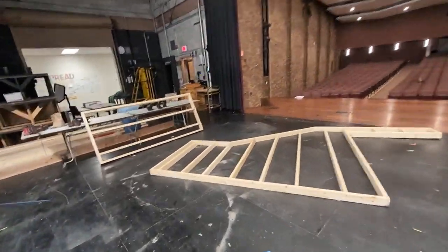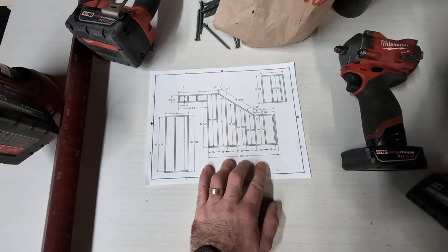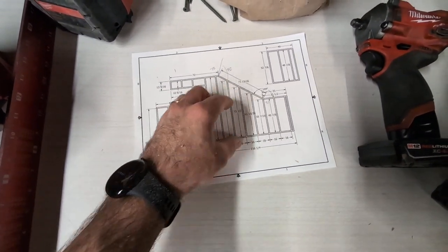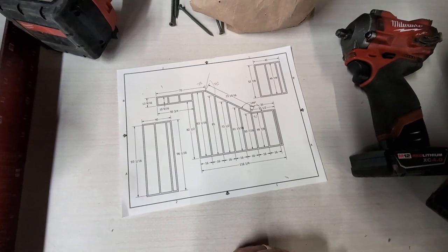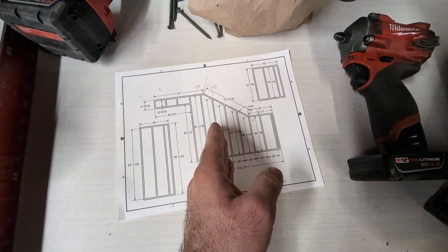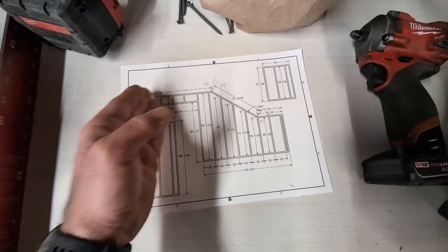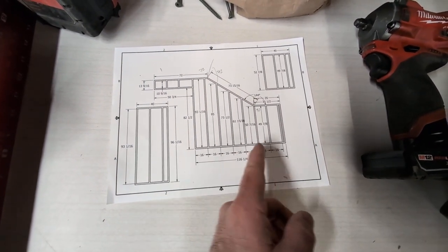Okay, that's all the components necessary. Now I waffled here, and I see what the biggest problem was. These are all called out as 16 inches on center, to the left-hand side of these sticks, starting here, because it makes it handy to lay out. You always try to go with a horizontal application of a 4x8 sheet with respect to the direction of the stud. So either starting lower right hand or lower left hand would have been handy. In this case, it would have obviously been started over there and played out in this direction. But I started here and filled to there.